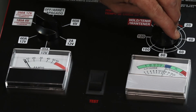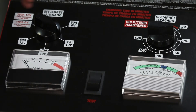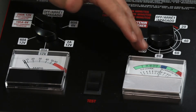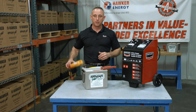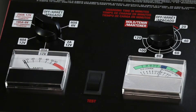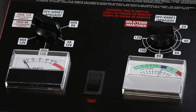Let's go ahead and turn it on using the timed feature. We want to monitor the amount of volts that the charger is applying and keep it at 15 or below. If the charger doesn't have a voltmeter on it, we can simply use a multimeter to test the voltage. If the voltage is 15 volts or below, we can write 'AGM' off to the side — now we know that this is safe for use with AGM batteries.